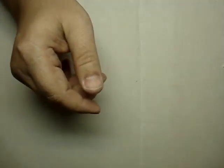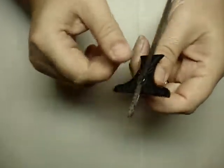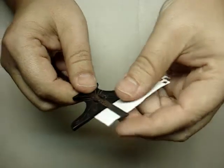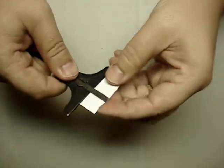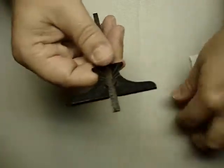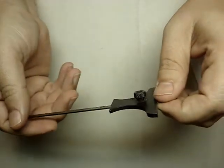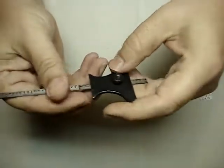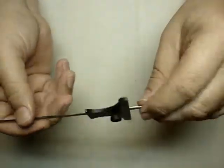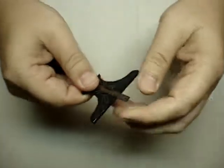Here is a tool that my son gave me — it is a depth gauge. I use it on styrene: if I want to make a mark that's equal on both sides, I just use this depth gauge and I am right on it. You can also set degrees, but I have another tool for that. And this tool right here — I think it's PEC — has been very instrumental in my latest scratch builds over the last two years. There are no markings on it. It's a wonderful little tool for your arsenal if you want ultra-precision markings. They use it in CNC work, I think.